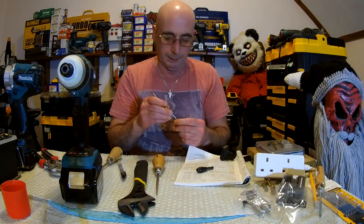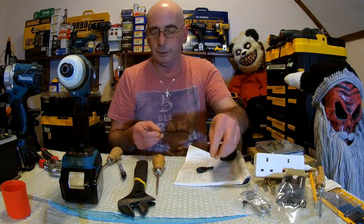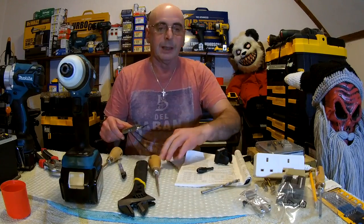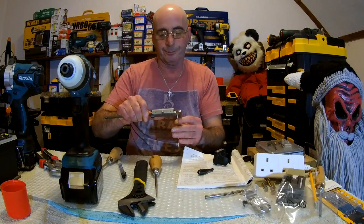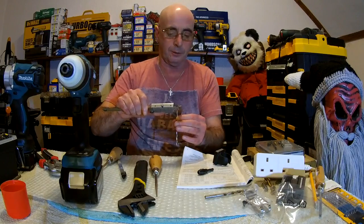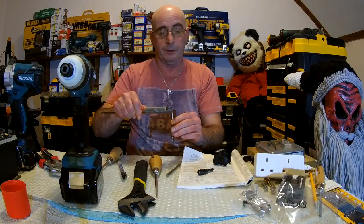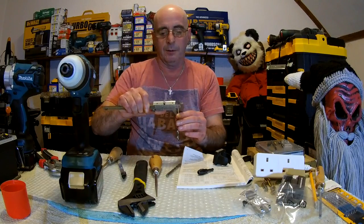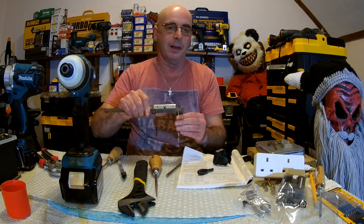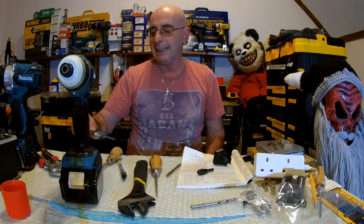Because, I bet you, that isn't 6mm on the shaft. No? Feels like 6mm on the shaft. Pause this just now, go and check. Just as I thought, it is 5.76, right, on the shaft. This should be slightly under 5.95. So you see the difference. I thought that might happen, and it did.